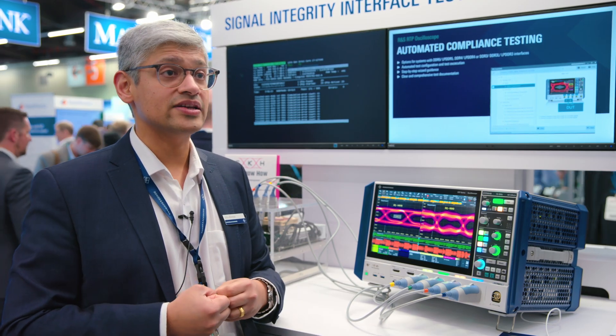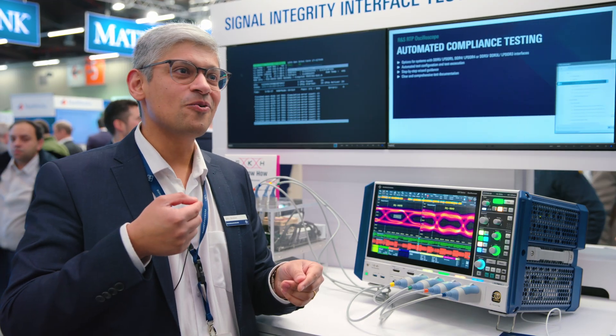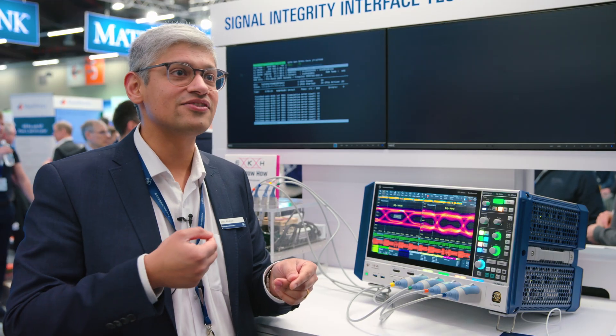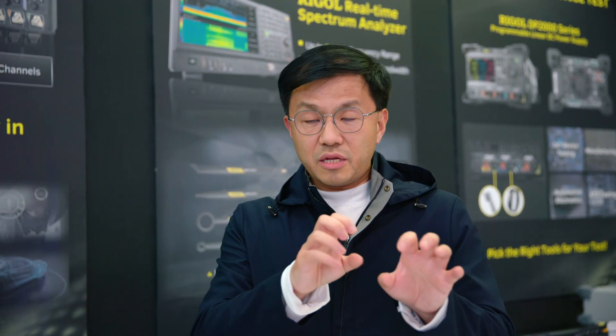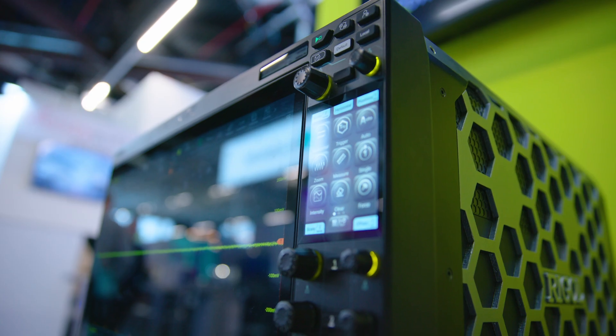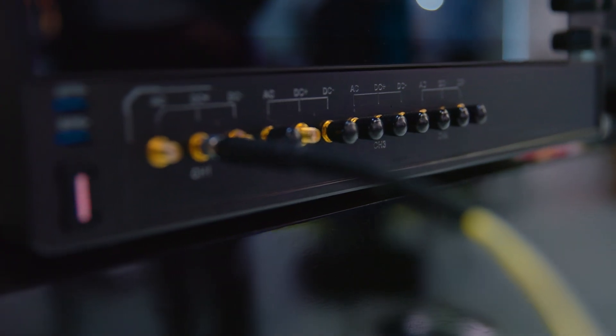The main thing you want to reduce is the amount of loading on your system. Any inductance on the line, or the amount of capacitance you add to the line, tends to bring the signals further down. We can use higher impedance to capture signals more efficiently, because — depending on Kirchhoff's theories and separating the loading effect by the circuitry — if you have a higher impedance, you can retrieve a signal more efficiently with the oscilloscope.